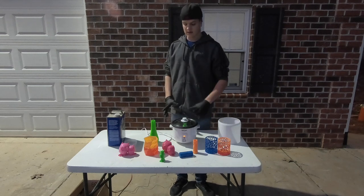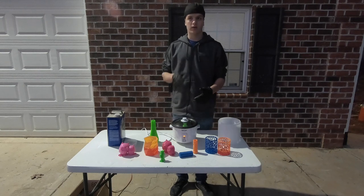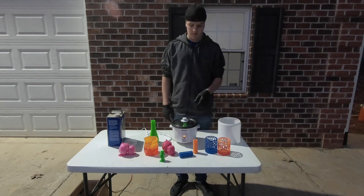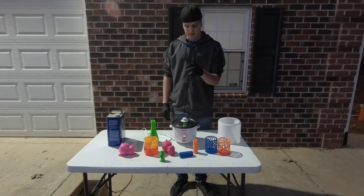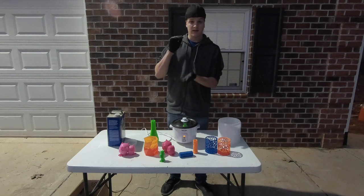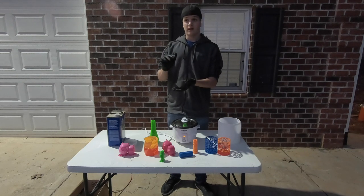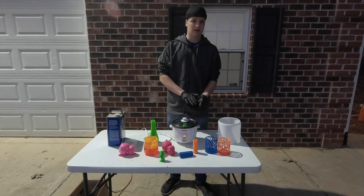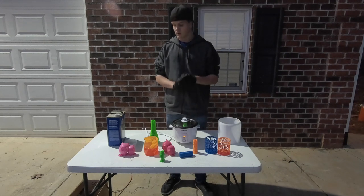You don't want to get this thing super hot where it'll auto-ignite the acetone and cause a big fireball. I've singed off a few eyebrows doing that. Basically when the acetone stops evaporating it stops cooling itself, and therefore it can auto-ignite — the hot plate will get hot enough to auto-ignite the acetone, which is not good.